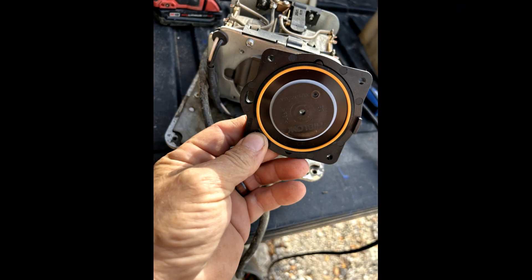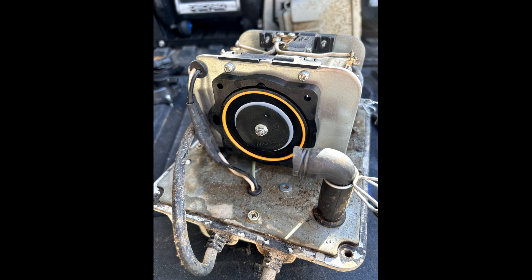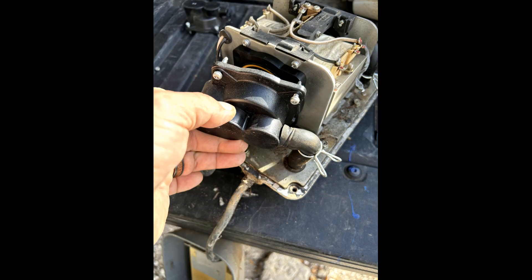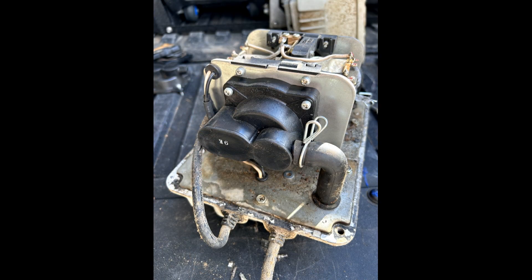This damage may be present on only one, but both need to be replaced during the rebuild. Line up the new diaphragms on the rod block and tighten down with new washers and lock nuts — snug these up but do not over tighten. Once both diaphragms are snugged up, you may need to wiggle them a bit to seat them in the metal base. Place the diaphragm housing back over the diaphragm and snug up mounting screws — do not tighten down too hard. Replace the L-tube and clamp and repeat on the other side.